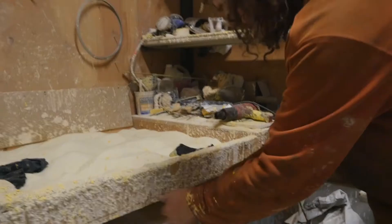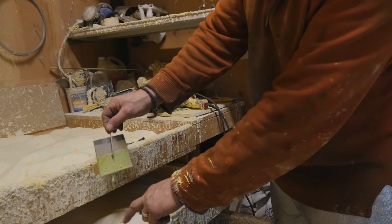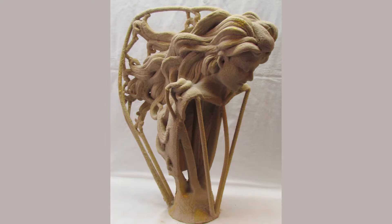We do this over and over again, dusting each layer in between with fine grains of sand. We start off with super fine — two coats — then two coats of mid-range sand, and finally a coarse sand, building up sometimes as many as 12 layers, sometimes as thick as three-quarters of an inch of ceramic around everything.